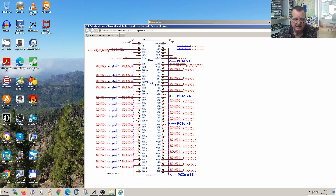This is the pinout for the PCI-E connector, 16 lanes. You can see here it says 'key' - this is where the slot is in the PCI-E fingers, so you can obviously only put the card in one way round. On the short section of the connector, we have the component side and the rear side. On the component side, the first three fingers are 12 volts, then a ground, then two connections called SM clock and SM data. This is the SM bus - a serial data communication bus connecting the device and the slot.